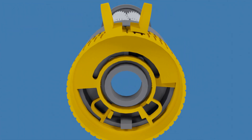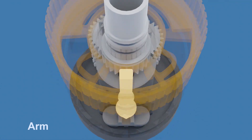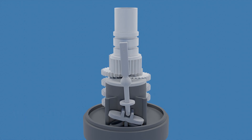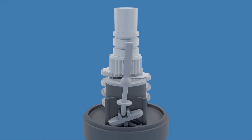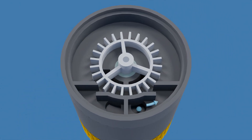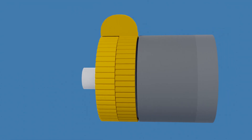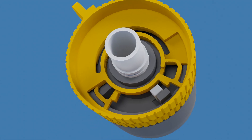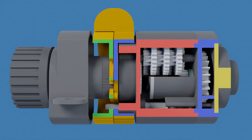But how can we change the direction of rotation when the stop reaches the end of its travel? There's an arm mounted just above the stop. This arm controls a diverter plate that pivots between two water inlets. The purpose of the diverter plate is to direct the flow of water alternately from one inlet to the other, ensuring that only one inlet is open at any given time while the other remains closed. The first inlet allows the water to turn the water wheel clockwise, while the second allows it to turn counterclockwise. During operation, water flows through the first inlet to turn the water wheel. When the stop reaches the end of its travel, the arm is pushed back in the opposite direction, pivoting the deflector plate, closing the first inlet and letting water flow through the second one, changing the direction of rotation of the water wheel. This action is repeated each time the arm reaches the end of its travel in both directions, causing the sprinkler to oscillate back and forth.